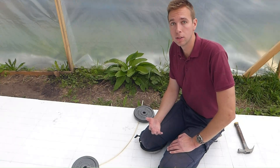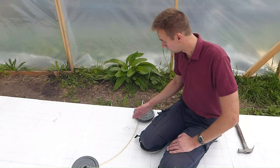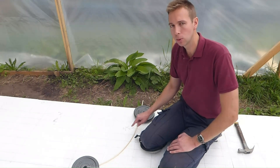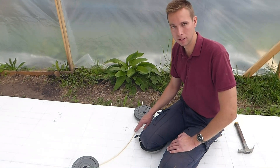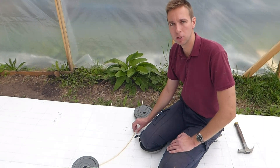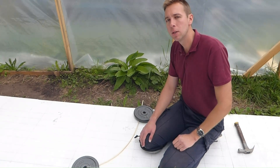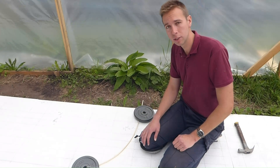The next line that we draw is the profile — the actual front of the boat — and you can see that I'm in the process of making it; it still needs to curve around more that way. A word on these battens: this is actually the second time that I've tried to draw the profile, because the first time the batten snapped. That was because I had made it 8mm thick, which was just a little bit too thick. So I've narrowed it down to 5mm, and that works fine.